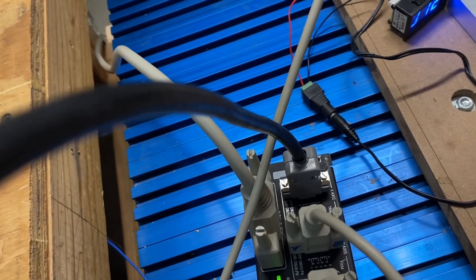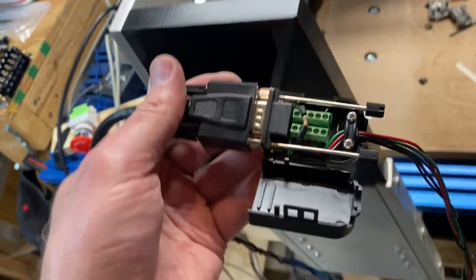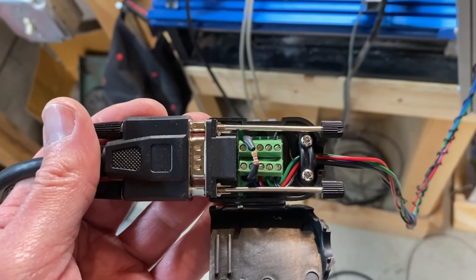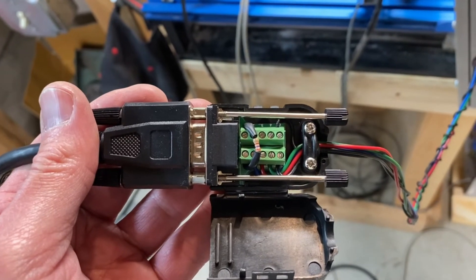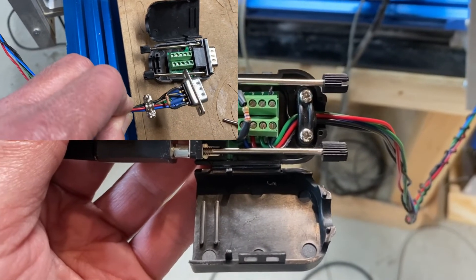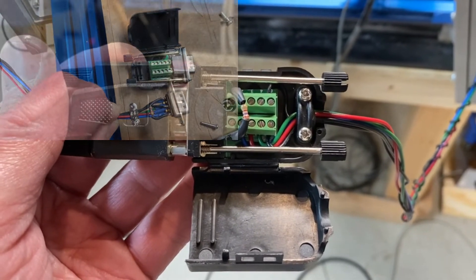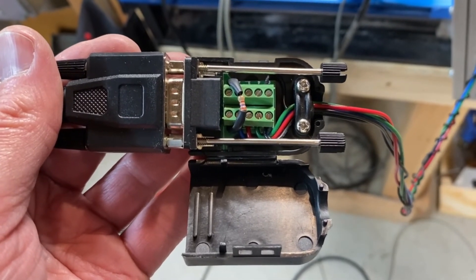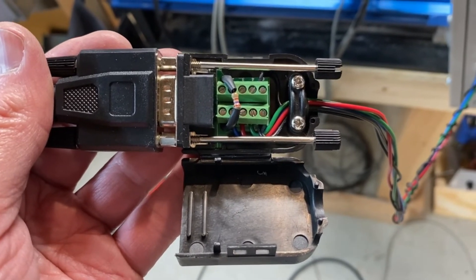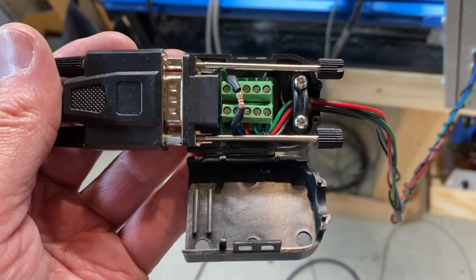Let's retrace those steps with the more substantial cable in place. On this end I repaired the connector I cut off with a soldered-on one. This more substantial cable comes around and goes into this no-solder connector — basically an easy way to take raw motor leads and connect them to a DB9 without soldering. I also tucked in the current limiting resistor for the G540 in there as well. To be honest, soldering is quick and easy for me and this one was a little fiddly, but it might be easier if I had to swap out a motor. There's apparently a next version that makes it easier — anyway, it's done.